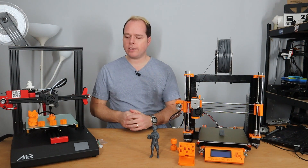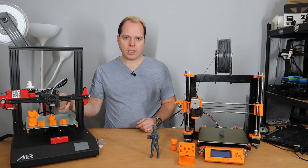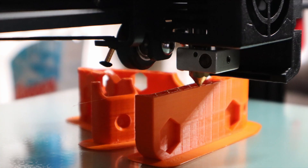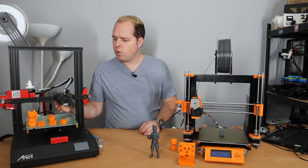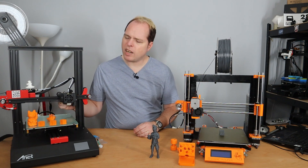When installing this 3D printer, make sure the bed is not too loose, and use the eccentric nuts for the carriage and for the heat bed carriage. One other thing I'd like to address to ANET: the placement of the brackets where you put the timing belt is pretty low. When I move the carriage back and forth I hear a sound — I don't know if it's normal, but I don't like it.